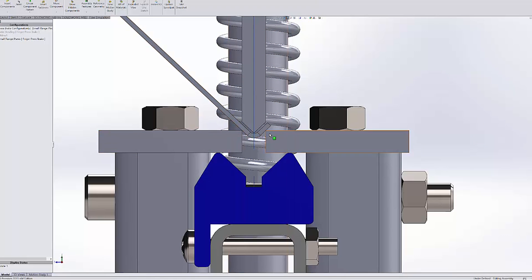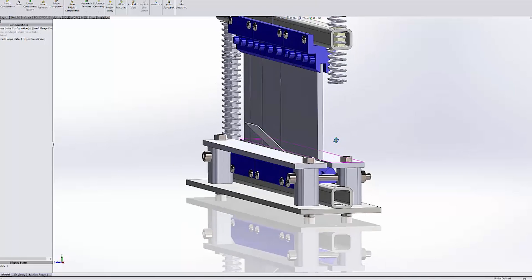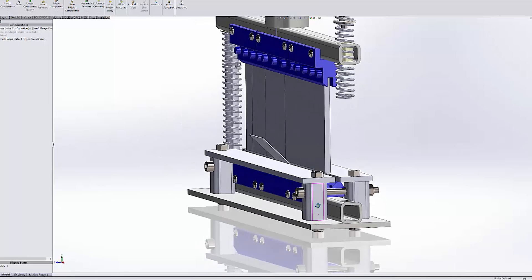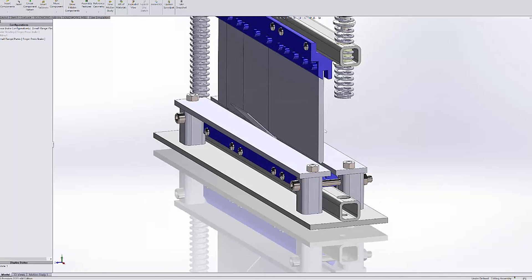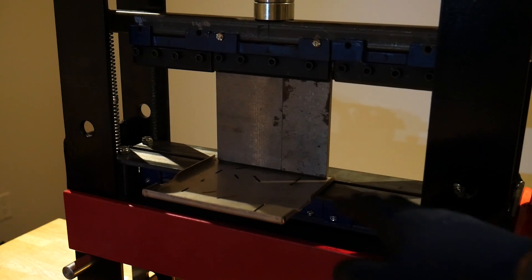You may want to chamfer the corners of these plates to avoid scratching or damaging your material — small chamfers will help the material slide smoothly. The two plates are also a quarter-inch thick, held vertically with long socket-head bolts going through the square tubing, and there's an optional horizontal bolt that may come in handy when bending heavier gauge material to keep the plates from pulling apart. All the plans for these optional plates are included with the rest of the drawings in the link in the description.